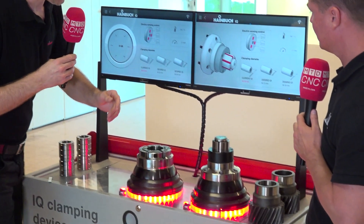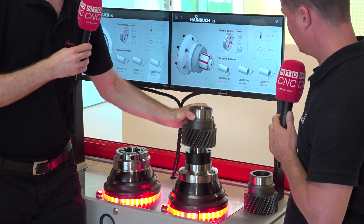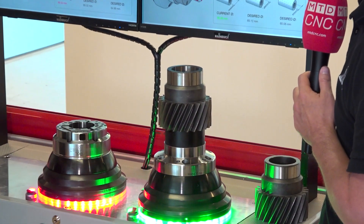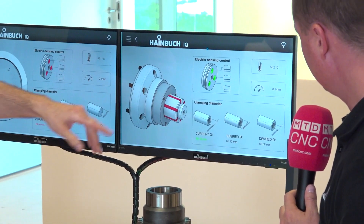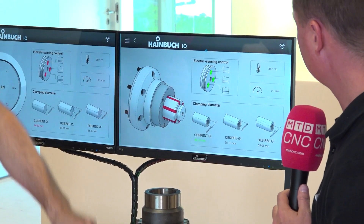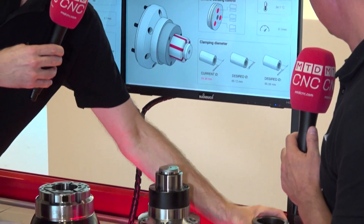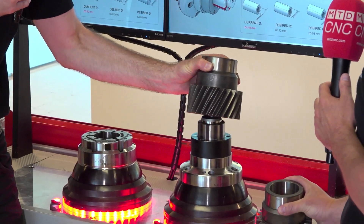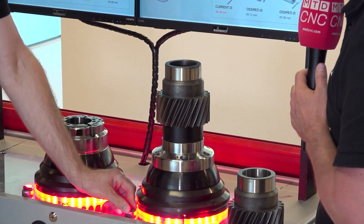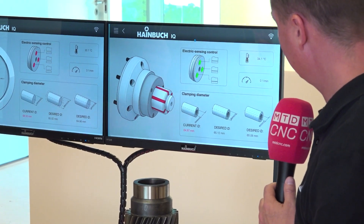The mandrel can do more or less the same. You see here the workpiece — the inside is shining, so that's the good one. I clamp it, the diameter is okay because I teach it before, and the endstop is also good. The other one is usually dark — no pre-machining here, which would be bad for the grinding machine. When I put it on the mandrel, it says, sorry, no correct diameter — put it out of the line, there's something wrong.